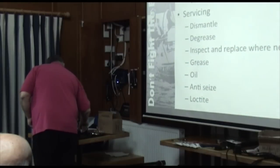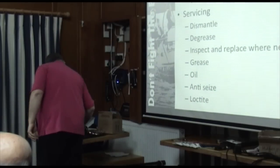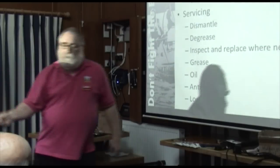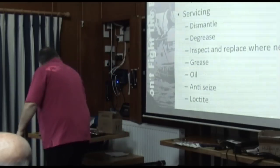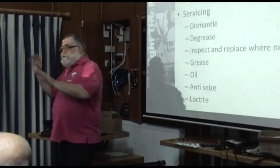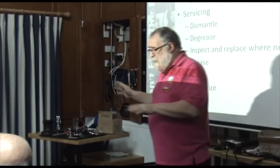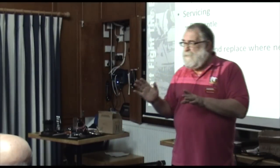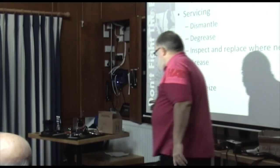Yeah, all the gears come out, all the washers, another pawl gear, another ratchet gear, another washer, until I've got a great big pile of metal. Now, you may wish to do it in a more sensible fashion than that, which is to say, you start with going, oh yeah, those bits are that one, those bits are that one, and then you know how it goes back together. You can get the exploded diagrams of our winches and most of our competitors' winches off the web. So if you're in any doubt about how it goes back together, get that.